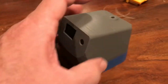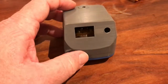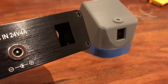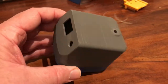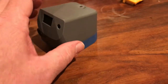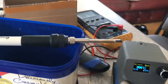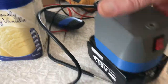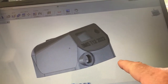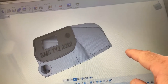My little enclosure is angled so that the display looks up at you a bit more, the soldering connection is further down the front. This one worked — it uses the switch that was in the back of the original box. I thought I could further improve on the appearance of this first prototype of the battery-powered soldering iron; I've just printed that enclosure and it's working. That's the iron that comes with the kit — I'll just use the power switch that was on the module. This is a redesign of the enclosure with larger radius corners on the top and also a border around the display with some text.